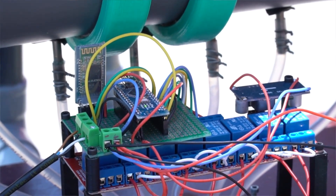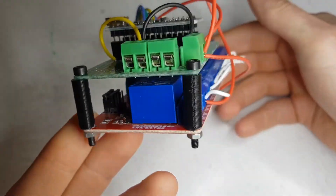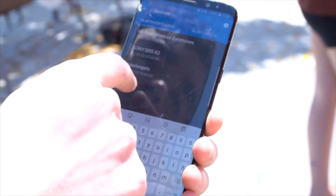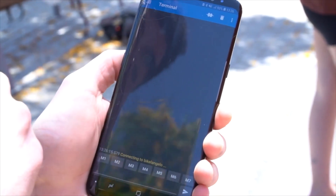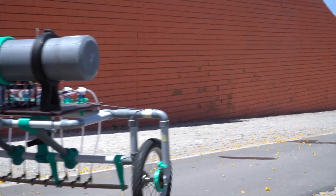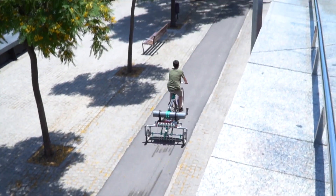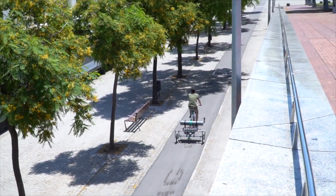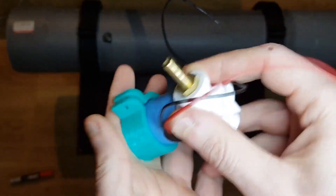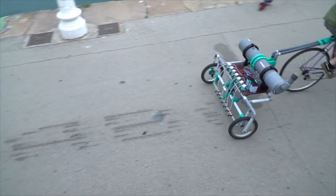Finally, there's the Arduino aspect of the project. He's using an inexpensive Arduino Nano with a Bluetooth module and a Hall Effect sensor. The Bluetooth module allows you to communicate with the Arduino over a serial connection and then type in the message you want printed out. The Hall Effect sensor is positioned over a hub connected to one of the back wheels — there's a magnet in this hub which the Arduino senses to know it's moving and how fast it needs to work to print the message. It's a cool project; some more details would be nice and some subtitles for the video, but there's enough here to get you what you need.